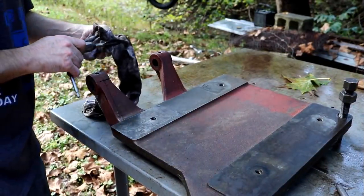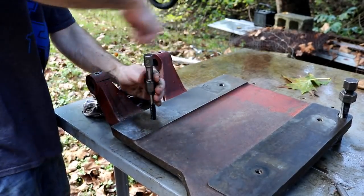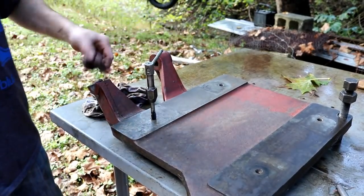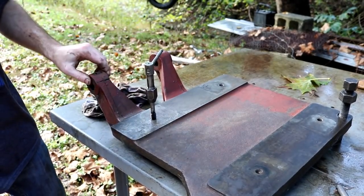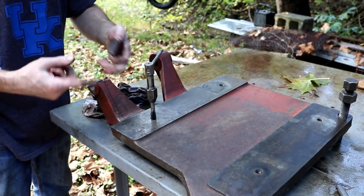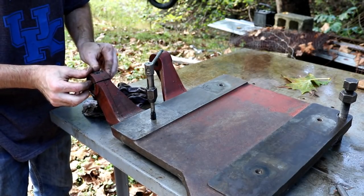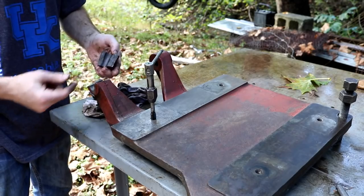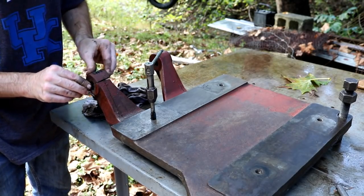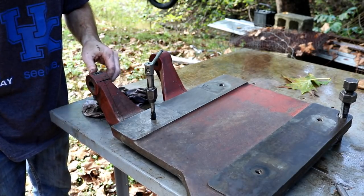rough. All right, this motor bracket is not as clean as it's ever been, but clean as it's been in a long time, that's for sure. And I'm super glad I found that piece that's broken off. Originally I was thinking I was gonna have to make this whole top, but now that's not the case. So I'll just clean it extremely good. I'll burr it out real heavy, all but a couple small strips so I can keep my original bore size and alignment. And then just braze it.